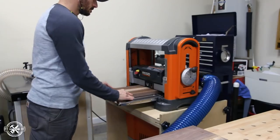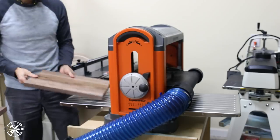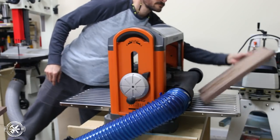Next I ran the boards through my planer again to get flat parallel surfaces. These faces that I'm planing will be my glue surface for the next glue up, so getting them smooth is really important. But don't overdo it here either — you want the boards as thick as you can keep them, which you'll see why in a minute.